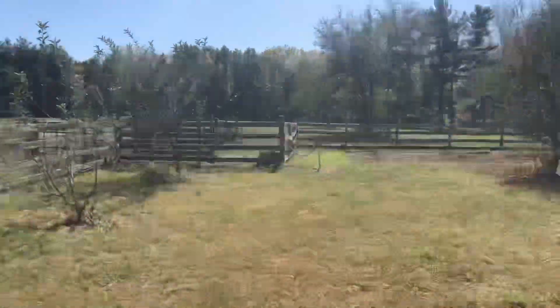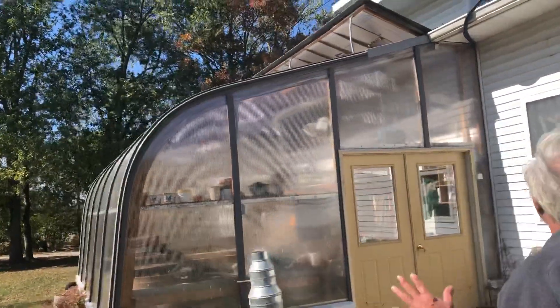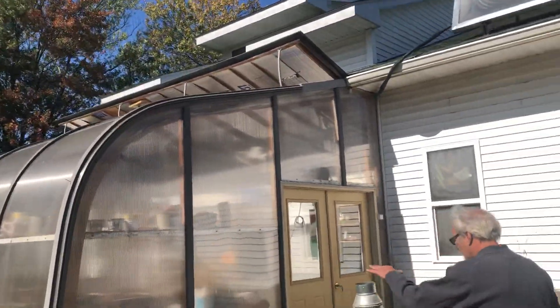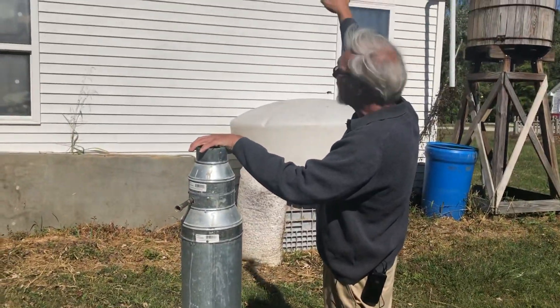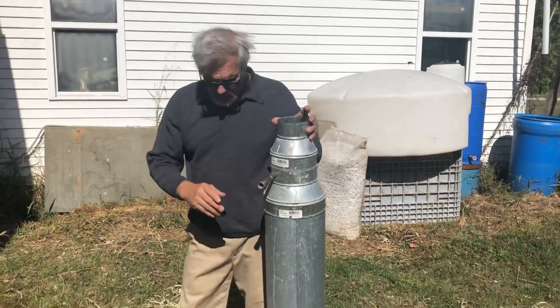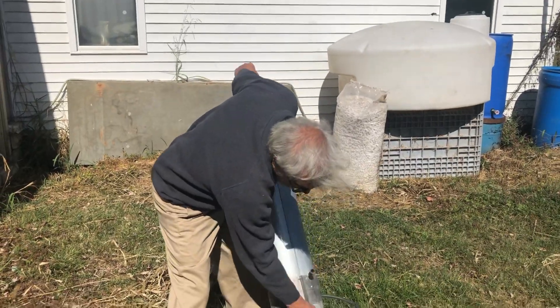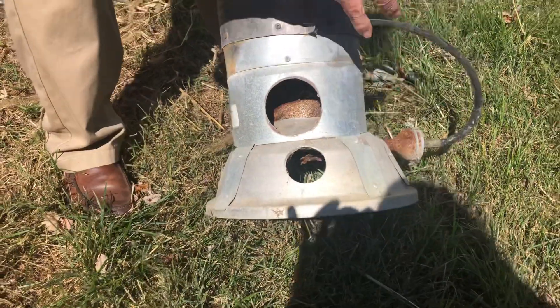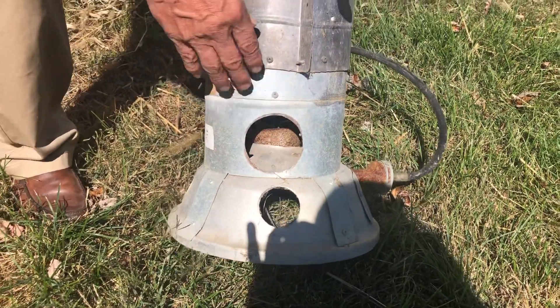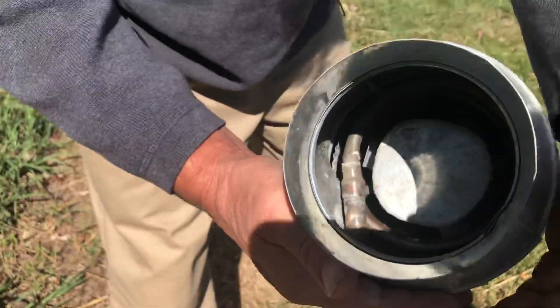This greenhouse was something that I also made. We can poke our head in here a second. I did want to show you this — the whole heating system for this got pretty complicated. This is my little turkey fryer heater that I made. We got a turkey fryer in here — this is just the thing you'd use when you got your hot oil turkey set up. And then I made a heat exchanger out of copper tubing. That goes into the bottom and comes out the top.